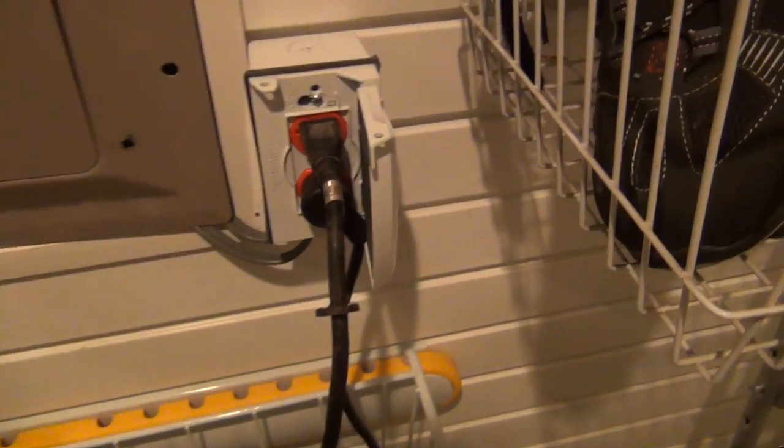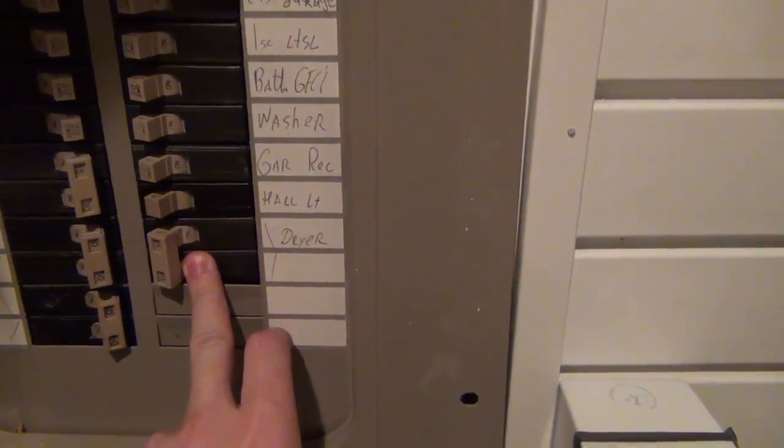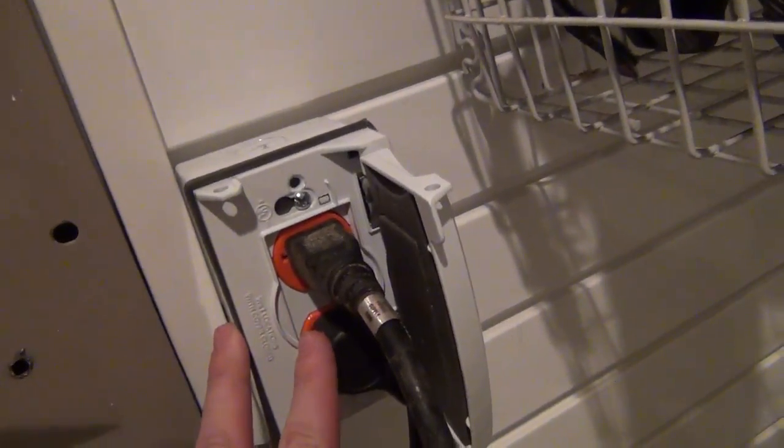This panel today was all open and I added something quite interesting - this plug right here. I took this dryer circuit breaker and reduced it so it can do two outlets. On top of that, I wired in my own contraption which intercepts the power going to that red outlet upstairs. It takes the UPS - the uninterruptible power supply - and intercepts it. So one of the power lines coming out of this breaker panel, instead of going directly upstairs, goes through this, then filters with this extension cord from the battery backup side, back into this, and all the way up to my apartment. Now this thing that hums and buzzes and interrupts my audio will not be doing that anymore.